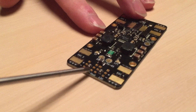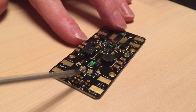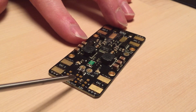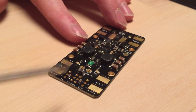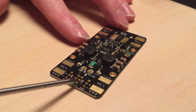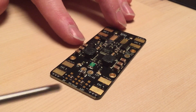We've also got a video-in and video-out pin — this is a 12-volt output, and it's filtered. It uses a PI filter, which is kind of like an LC filter but with another capacitor in front — so it's a CLC filter. That gives a little bit more filtering. We have camera-in and VTX-in connections, just two servo cables, nice and easy.